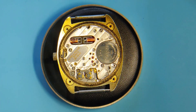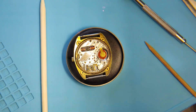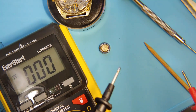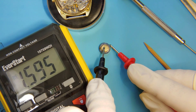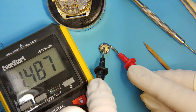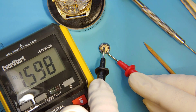So we are going to remove it. Remember, when we are removing a battery, we have to use something different than metal, because metal will short the cell and shorten its life. Negative and positive — and here you can read 1.59095, so it is close to 1.6, which is good. It is not a brand new battery, but it works. 1.598 — so close to 1.6 voltage, so this is great.